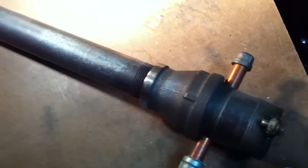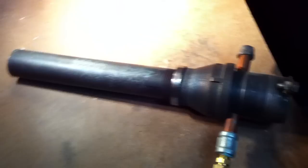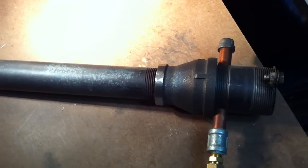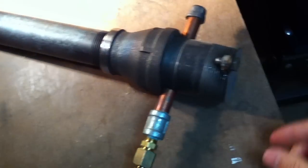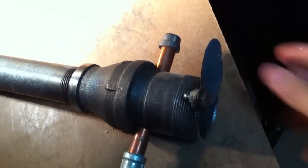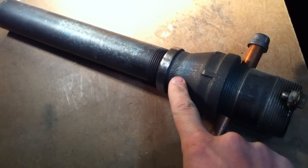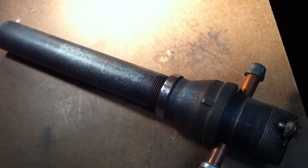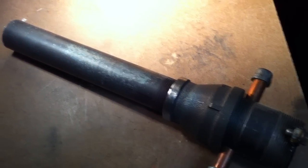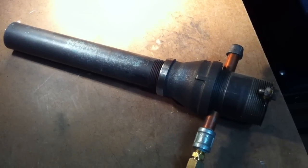And the other thing that I made was the burner. I'm using propane, and this is what we call a Reil, R-E-I-L, I believe it's spelled, burner. And I made a choke, and the propane comes in, it goes through this reducer, and just the air forcing it and reducing creates this swirl, which when the propane is ignited, it sounds like a jet flame. I think I actually have a video posted of me testing it out, so you can check that out.